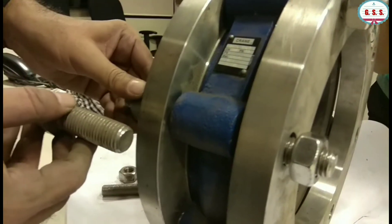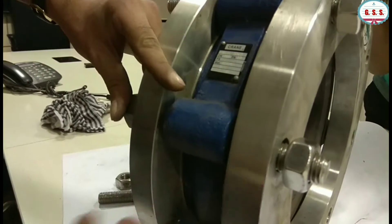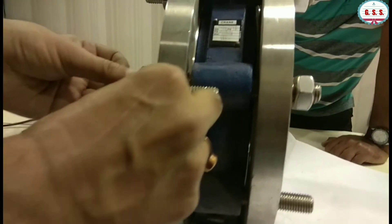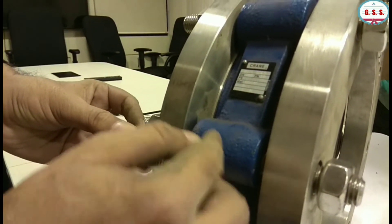So instead, start one bolting from this side and another bolting from the other side — this also serves the purpose. In that case, bolt length should be thickness of flange plus this much, up to a maximum of 50% of the valve width.